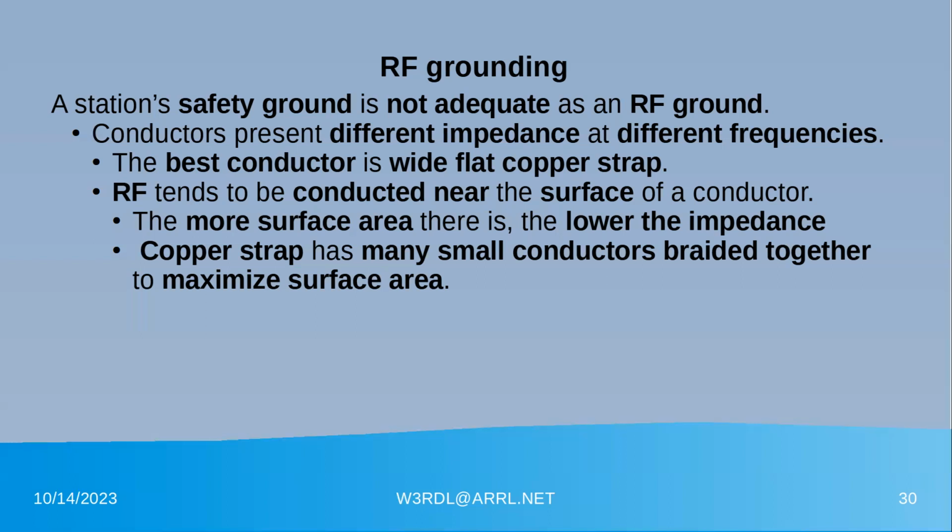Well, without the capacitive hat on it, or the capacitance up there, you're going to have some reactance. So the reactance figures into the total impedance. And remember, the impedance is radiation resistance plus resistance losses. So if you've got extra impedance in there, it takes away from it. Typically, if it's pure resistance, it is what it is. Now with the loading coil to offset the capacitance, somehow the reactance component gets larger. So now you've got your core resistance and the net reactance, which is a larger chunk of the total impedance.